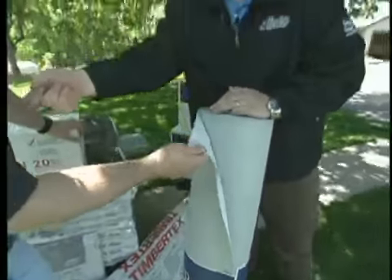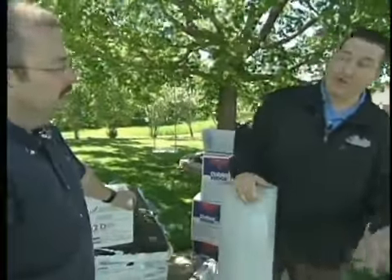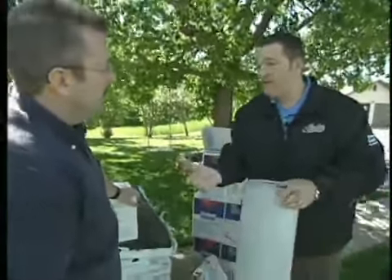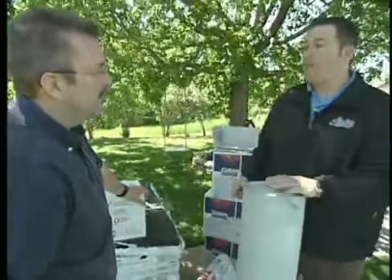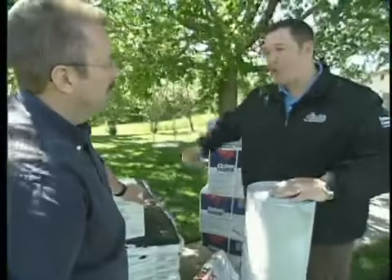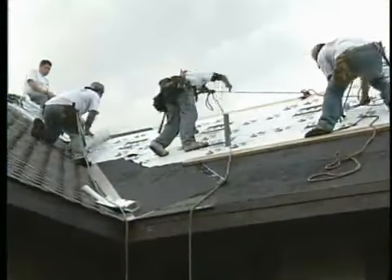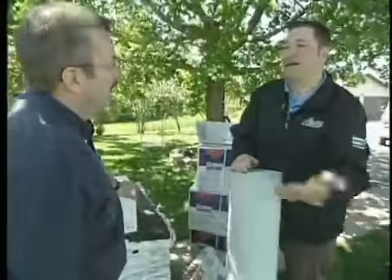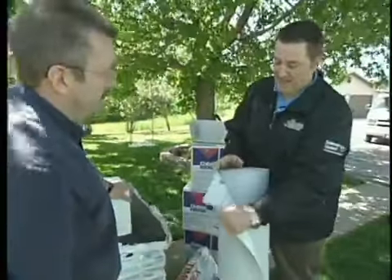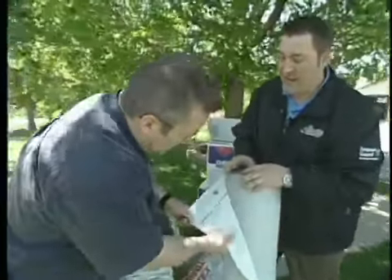I show people — this is what a lot of roofers use, your normal 15-pound felt. After that they came out with something a little bit better: a fiberglass reinforced 30-pound felt. Again, pretty easy to tear. The problem with those felts is every time you're up there whacking away with a hammer, those hammer tackers have a tendency to tear it — little tears about an inch long. Those tears can be a spot where it can leak. As you can see, the Tiger Paw is very, very tough — it's not going to tear.